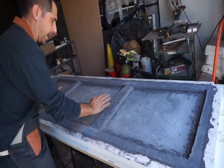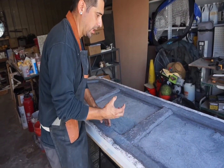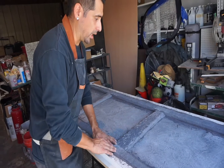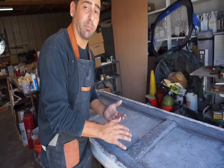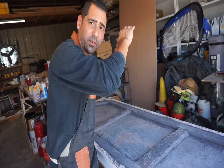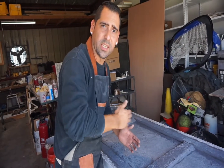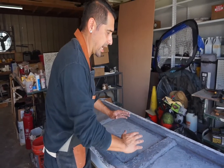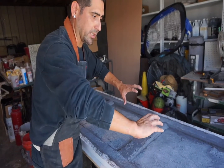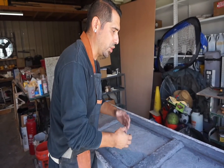We build up the profile edge like a picture frame all the way around. The only reason I added these pieces in here is because I can use the same glass fiber reinforced concrete with a heavier load of fibers and make this a structural, integral, almost like a vertebrae or skeletal system. It's just like the framing of a house — you have the perimeter like the box of the house, but then you have your framing in between supporting the drywall and the studs. That's kind of what this is doing, and it allows a lot more structural strength when we're flipping these molds around and carrying them. It gives it a stronger framing and you don't have to use rebar.